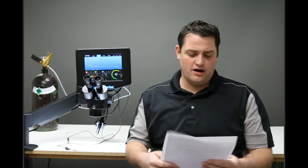One thing to mention: silver is a wide range. When we use the word silver, it can mean a whole lot of things — it can mean an alloy that's mostly silver, or all the way to fine silver where the majority is silver at very high purity. Each of those is going to weld just a little bit differently. With the Orion we can weld any type of silver, but there are a couple of things to be aware of, and one of those is zinc.